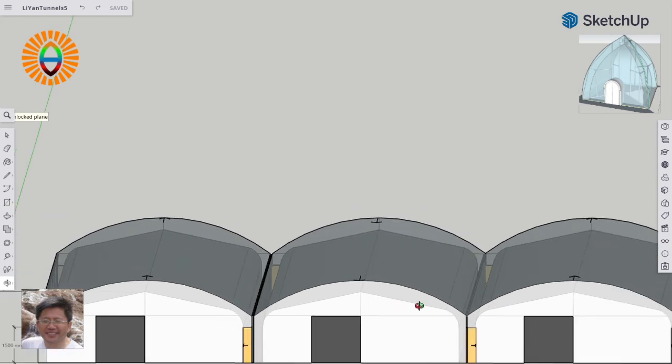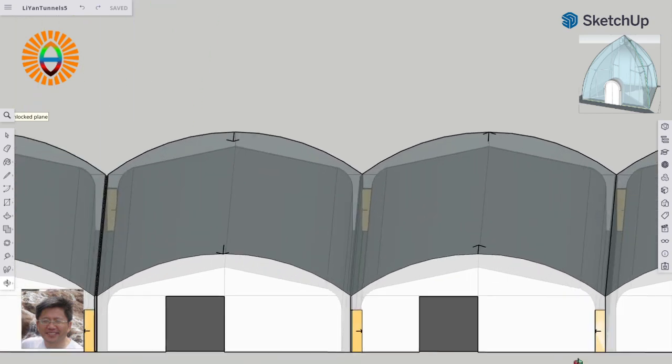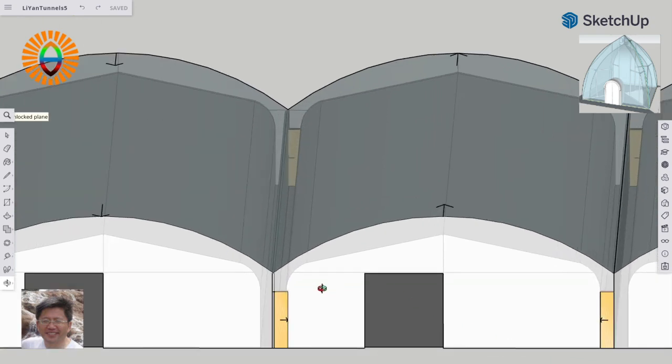So hopefully you understand. This is another way to apply the SolaRoof technology, and you see how we can easily retrofit the existing greenhouse, using the same profile, even the same fabric. If the fabric is relatively new, you don't need to change it, right? Because we simply use it to hold bubbles, and then we simply create a canopy. We use two frames in this shape, one at this end, one on the other end, and then we simply use that to hold the exterior cover, and then we blow air.